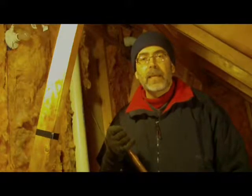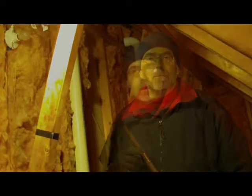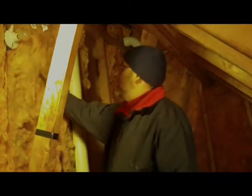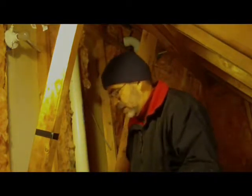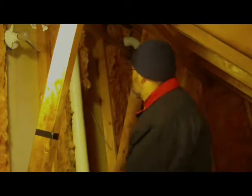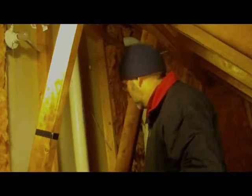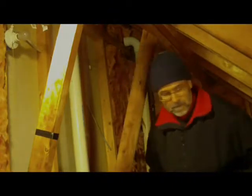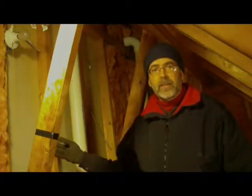So what I'm going to talk about is replacing this and the procedures for replacing wet insulation. The first thing you want to do is take out the insulation that's been wet. I'm going to grab up here and just pull this away. I try to move as slow as I can because I don't want to get a lot of dust stirred up. You want to take this and discard it as quickly as possible.